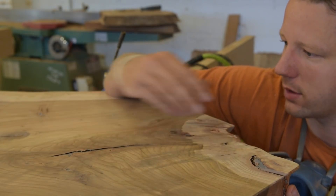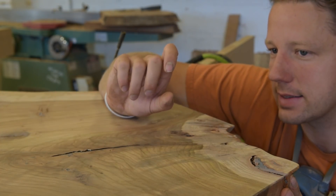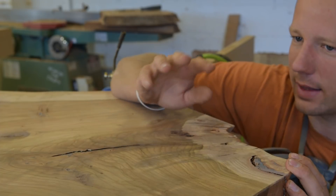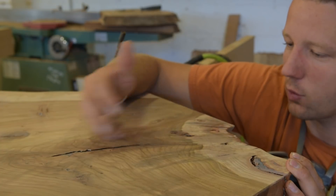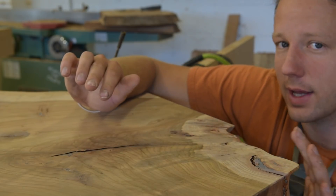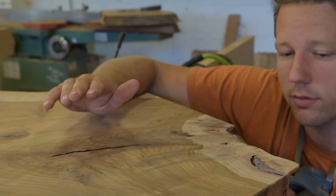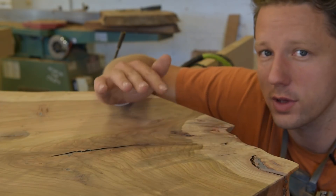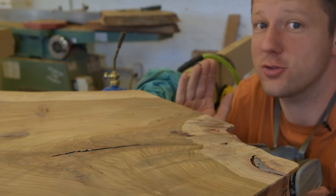The stuff won't keep soaking into these cracks — who knows how deep they go into the wood. So I'm going to do another coat of epoxy and add a little bit of extra catalyst, even though I totally screwed it up last time. I put extra catalyst in my big batch which heats up in the pot really quickly, and then it went off too fast — I waited too long to start pouring it. But if you put a little bit of extra catalyst in, you'll still have about 20 minutes to pour and work the stuff before it starts to go off. That way it hardens quickly and I can sand it and get a finish on this today, because I'm just so impatient — that's why I screw so much stuff up.